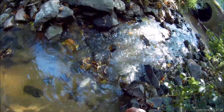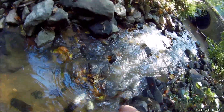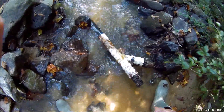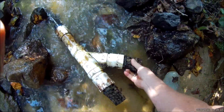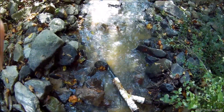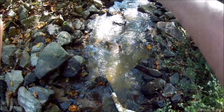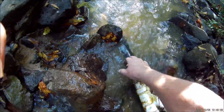It's a 2-inch pipe with a Y-split on it, and I've got some perforated filter-type attachments on the end of it. I'm going to put this camera down and use both hands to dig this thing clean. I removed the anchor rocks and lifted this thing out of the water. When I first installed this about five months ago, I used rigid PVC pipe — two-inch pipe — for my supply line. Twice in the first month we had a flash flood and it lifted everything up and broke my pipe. So now I'm using something called flex PVC.